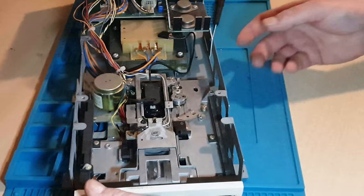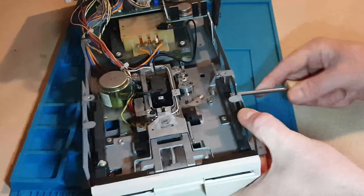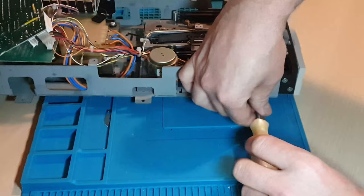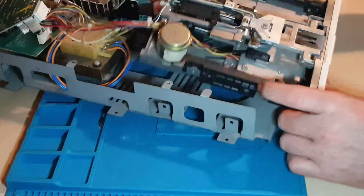So that's the two front panel screws back in. What I think I'm going to do is take out the two screws from each side and lift the drive unit out, and just have a quick look at the drive belt to be 100% sure the belt's okay. Once that's far out, the whole unit should lift up, squeeze past, and flip straight over.